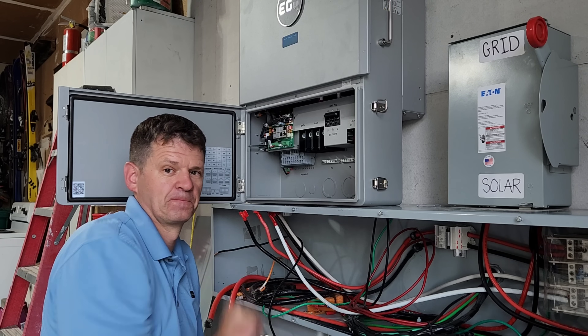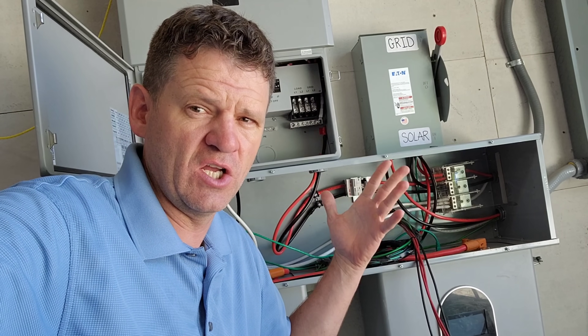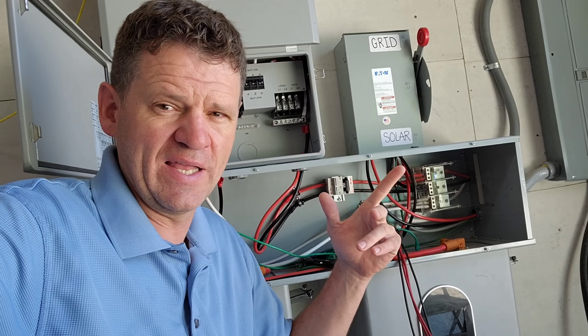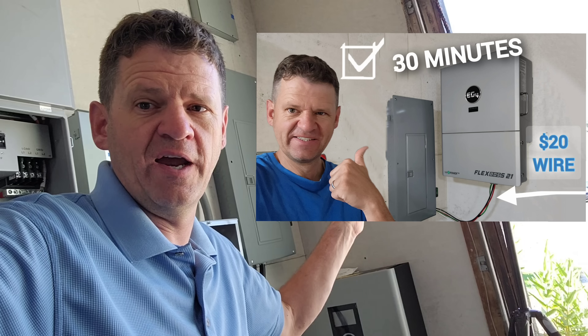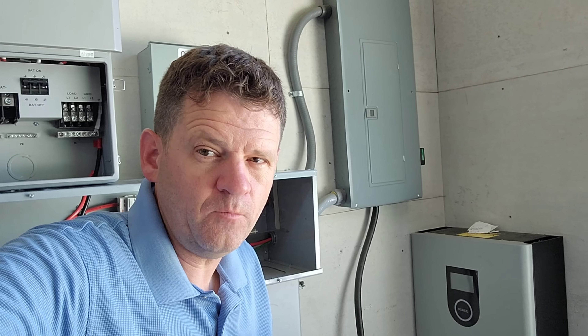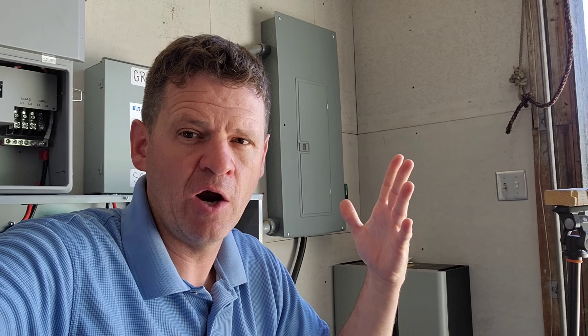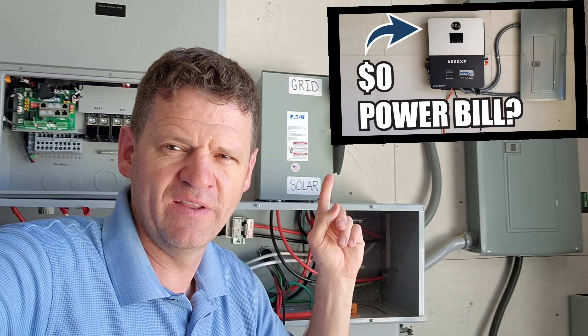Hopefully this Flex Boss will be around for a long time. One of the downsides of wiring it this way is there's just a lot of wires and equipment involved — it just takes a lot longer to wire. That's exactly opposite of the video I did last week where I had this Flex Boss and just did it in about 30 minutes with 20 dollars in wire from the store, using a back-fed breaker. Feel free to check out that video — in the description I left some resources on how you can determine how much you can back-feed and what size breaker you'd need. Back-feeding into the breaker is a little limiting in that you can't power everything in your house when the power goes down, but I did do another video where I use line taps. I'll leave a link to that video at the end.